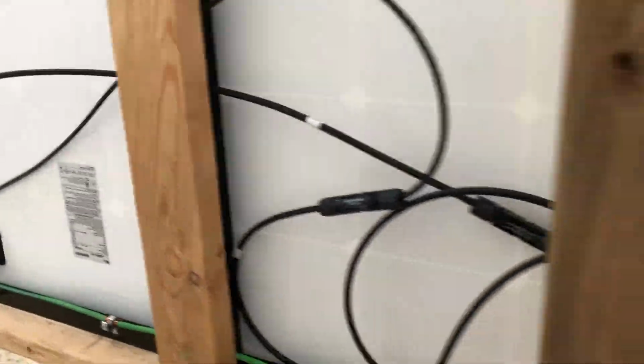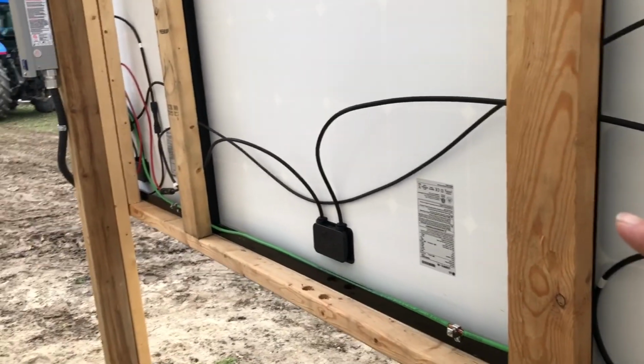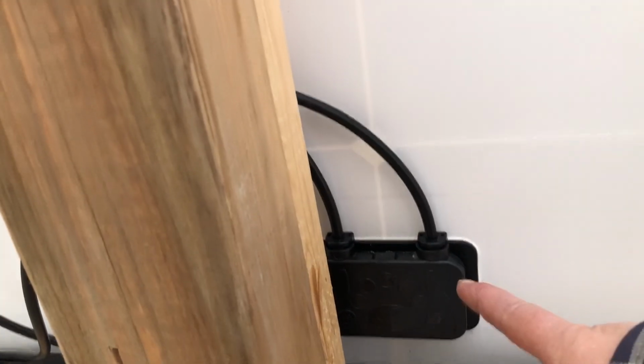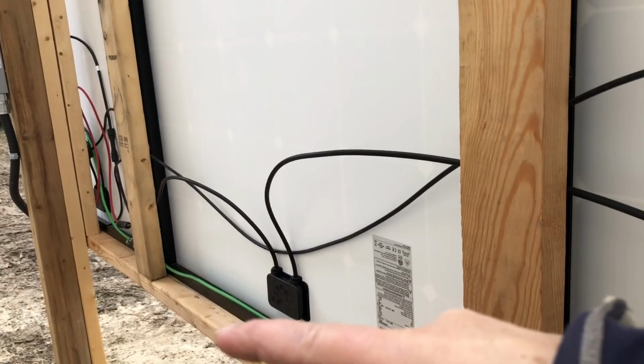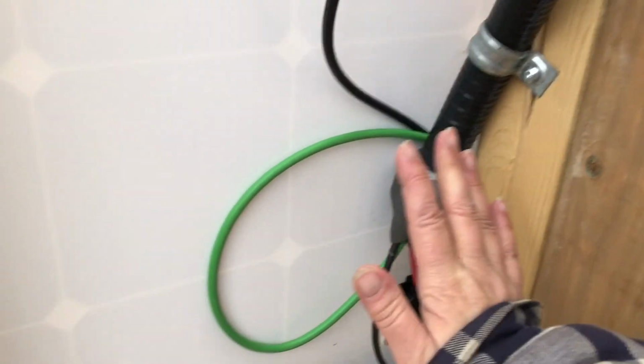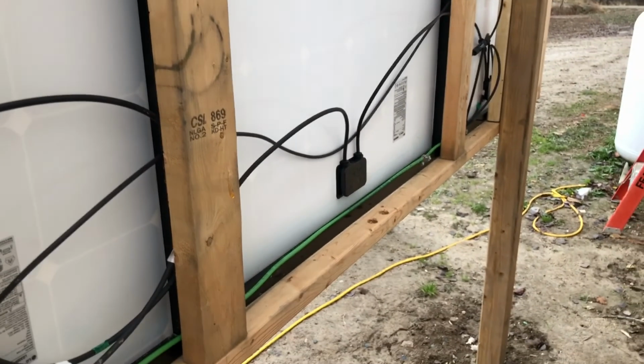Oh, I forgot to tell you that because, like I said, we're in Ontario, all these wires in the back have to be covered up. Now all Bob has to do is put on a piece of plywood on here and cover up. So even though they're all coated wires and they're in little boxes, you still have to have this covered up, which won't take too much. You don't have to cover it all the way to the top because there's no wires up there. So just from about here down to the bottom, cover those up. And of course, you don't have to cover this wire up because it's coated, it's got metal on it, it's got rubber on it. That one doesn't need to be covered up. This doesn't need to be covered up. So he can just cover that. So that's the way it is in Ontario to do it properly.